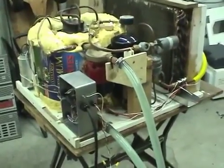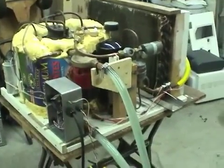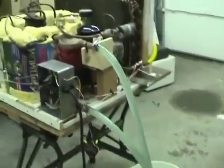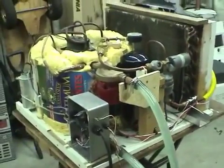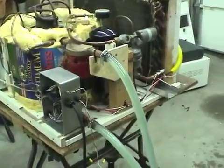This heater is for heating potable hot water, not for space heating. It works basically by circulating water from the water tank inside to this outside unit through some pipes. Right now I've just got it hooked up to a tank of water for testing. It flows through a water-to-refrigerant heat exchanger where the heat from the refrigerant is dissipated into the water, and the water is circulated back to the water tank.